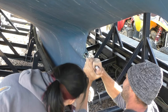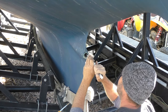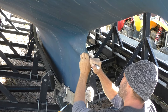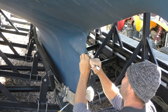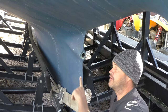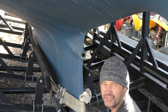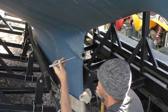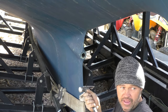Almost there — yeah, I don't want to go too far; I don't know how far I've cut back there. [kid appears] 'I just came over here to verbally abuse you a little bit and then leave.' I guess that's what kids do — verbally abuse their parents and then just leave. So I've cut two slits in this bearing, one here and one here. It wasn't that bad, it's pretty soft. Now I've got a drift punch and hammer — I'm going to try to punch through where the set screws go and see if I can fold this in and yank it out.